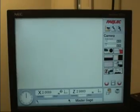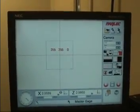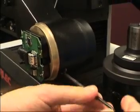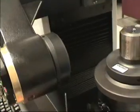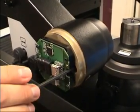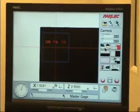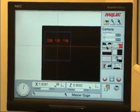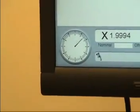From Presetter Setup, click the Focus Utility button. Loosen the 2 set screws that clamp the lens mount, and the 2 set screws that hold the ring light to the lens if you have the light ring option. Rotate the adjustment screw that will move the lens and camera in or out until the image is in sharp focus when the gauge optical sight is at maximum diameter as seen on the vision monitor.